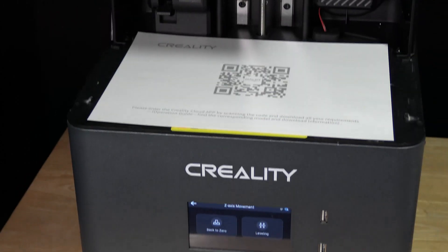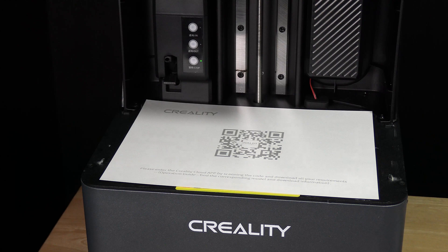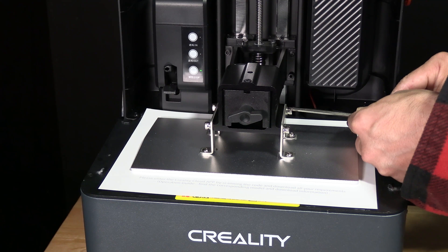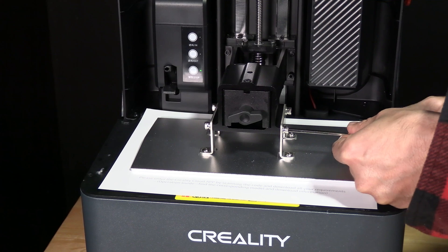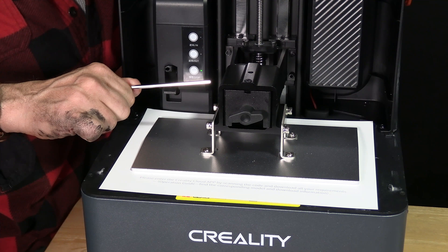That's what we want. Once we've reached that point, you're going to go back down and we are going to go to our menu and press the leveling button. You will see the print bed has come to rest on the screen. We will now go ahead and tighten those four screws to secure it in its resting position — we will start with the rear screws first. This will avoid the clockwise motion of the front screw from lifting the back of the plate upwards before it is tightened.